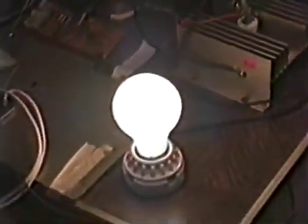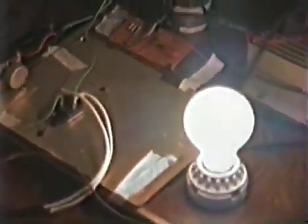Right here we see the SCR as part of the circuitry. There's a light bulb that gives an indication of the voltage across the capacitor. Here you see he's reduced this conditioning circuit to using only one capacitor. What's the capacitance of that? It's a 1600 microfarad capacitor, 250 volts, AC working voltage, DC working voltage. And he has a variac trigger arrangement set up and a potentiometer to adjust the circuitry, which he's now doing, as you'll see by the light bulb.